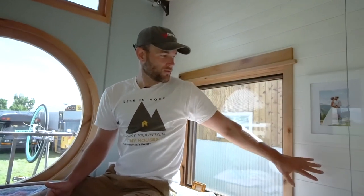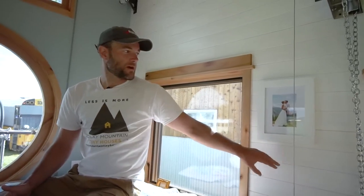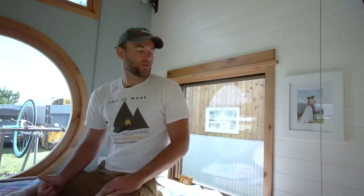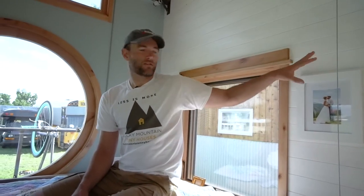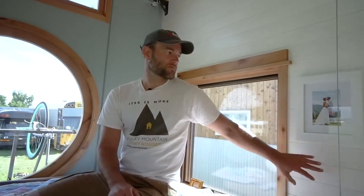The wall material is just quarter-inch pine tongue and groove — they call it a V-edge. You can buy it at Home Depot. I buy it in bulk by the pallet and get a discount. It's thin, it's light, and you'll see a lot of it in tiny houses. For the whitewash finish, you can buy a pickling stain off the shelf, or go old school — get white paint, water it down 50-50. That one-to-one mixture really washes the paint down and that's how you get your whitewash. Since it's a thinner finish, it's a good idea to put one or two coats of clear coat over it so fingerprints and rubbing won't damage it. The back wall is actually quarter-inch drywall.